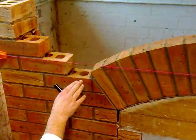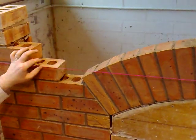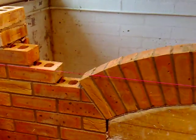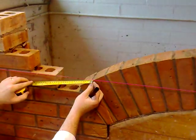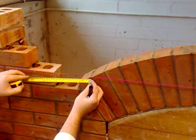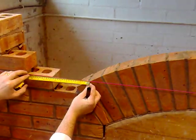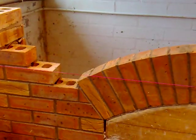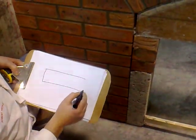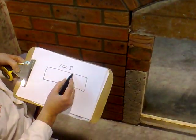This is how we measure and get the measurements for the birdsmouth. First of all, we set up the line flush with the top of the brickwork and we are going to use the line as a guide when taking our measurements. We hold the corner of the tape where the line meets the extrados — hold the end of the tape right there, as exact as possible. Measuring across, we get 165mm. We take away 10mm for the joint on each side, so 165 minus 20mm gives us 145mm. That is our first measurement.